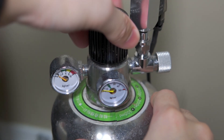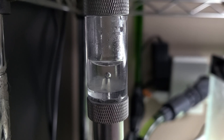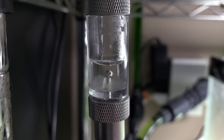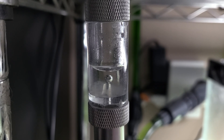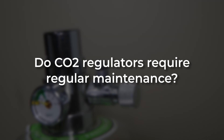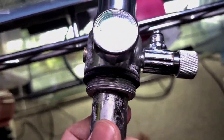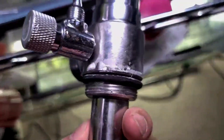And lastly, the pressure gauge not moving. I've seen this happen more in CO2 generators. The regulator may still work without it, but it can be a little dangerous not having that information. Do CO2 regulators require regular maintenance? Yes. You should make regular checks on any seals and O-rings for wear and tear. This will help prevent any leaks.